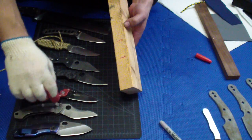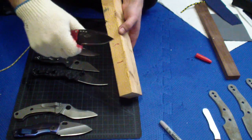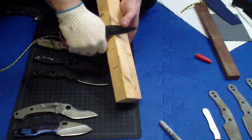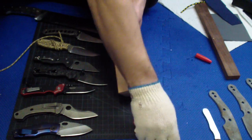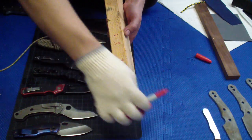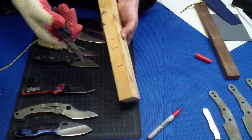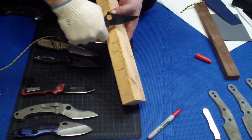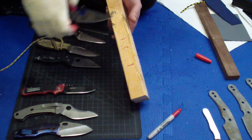So that was the Handsaw. This is one of the better hollow grinds, the Ram. It has a very big radius. There was that. A little more. Paramilitary: full flat grind with the regular secondary bevel, reasonably thin on the edge. There.